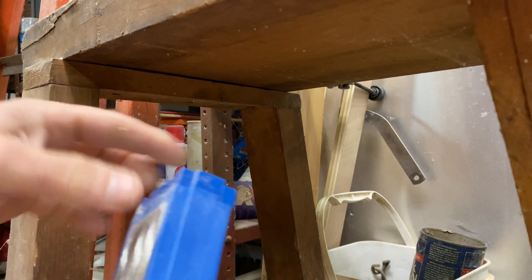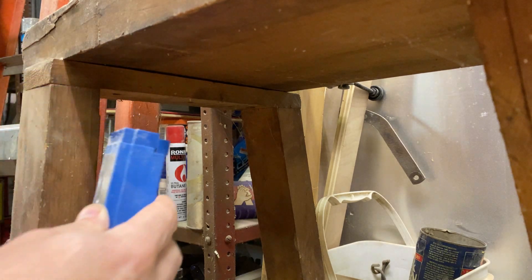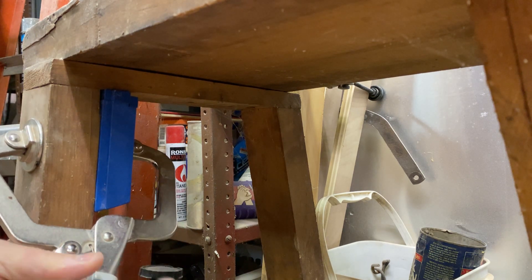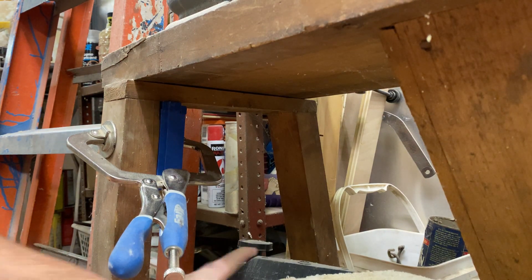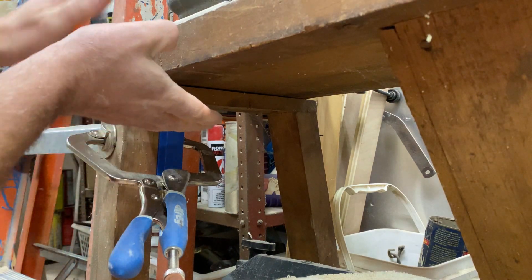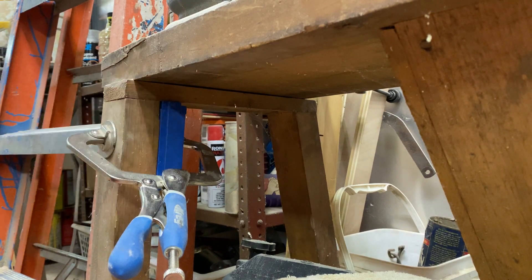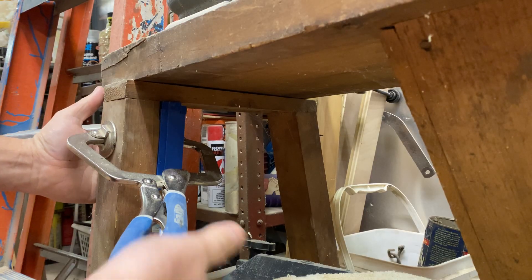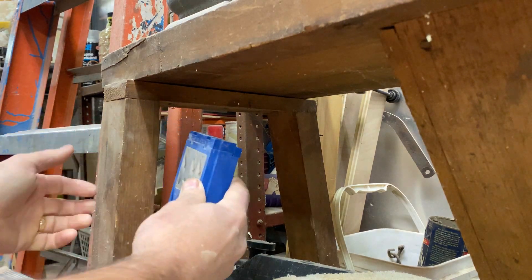However, if you take this portable piece — like I showed you — put the spacer block on, and set it right against here like so, take your clamp and clamp it in position. The clamp is adjustable, so you loosen it up, clamp that in place, and with everything out of the way, you can run the drill bit right up through the back side of this leg and then go ahead and put a screw up in, reattaching this table to this leg. To remove it, just hold onto the block so it doesn't drop, and pop the clamp open like so, and then take the jig down — and then you're ready to put your screws in.